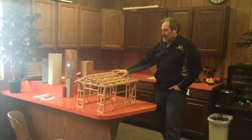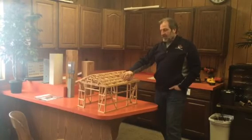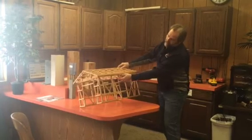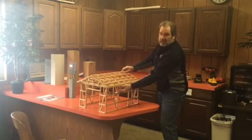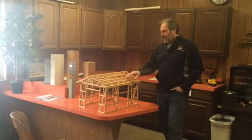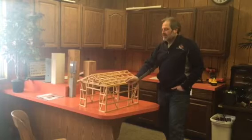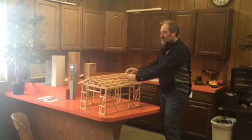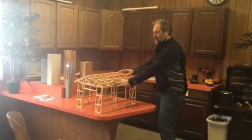Also, with eight, nine, or ten foot spacing they put the trusses on top of a pole. We have a double beam here on both sides of the pole with shear value screws or nails installed. The beam is installed that way, and that helps hold all these trusses up. These beams are engineered to withstand the weight of the truss and snow load, so this beam method works out great.